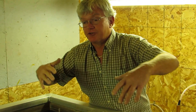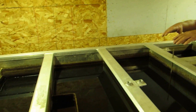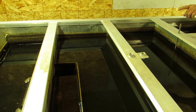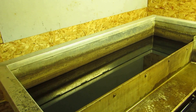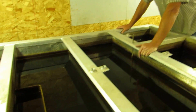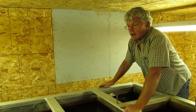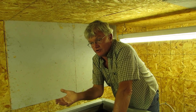As the water travels through the filter box it goes through and rises up over into the actual filter box on the end. In that filter box, the filter media is underneath — there are three layers of sand: a coarse sand, a finer sand, and then an anthracite sand on top. The particles stick to the top of the filter bed while the water passes through, removing all those particles.